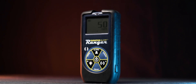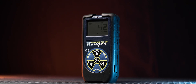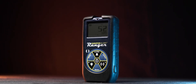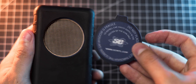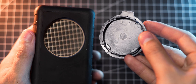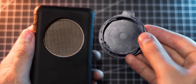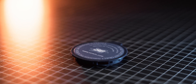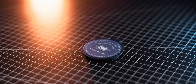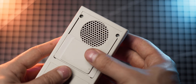The SE International Radiation Alert Ranger is definitely a great meter, and I really enjoyed using it over the last couple of months, but there's always a little room for improvement. Firstly, the plastic cap does not provide any gamma compensation or even proper beta shielding, which results in dose rate readings being highly inflated. I think it would be great if the cap included some sort of filter for gamma compensation. I'm also not the biggest fan of the cap design in general — I often find myself forgetting where I've left it. While a replacement isn't expensive, international shipping is. A slideable cover like on the MKS meter could have been a better design option.